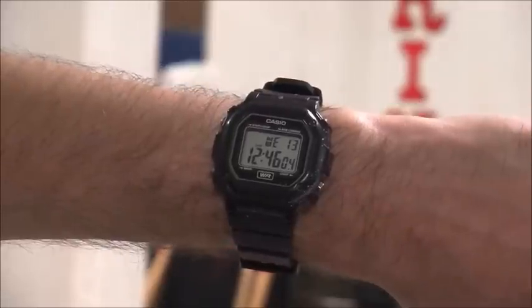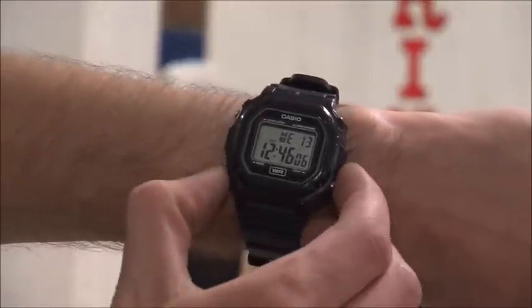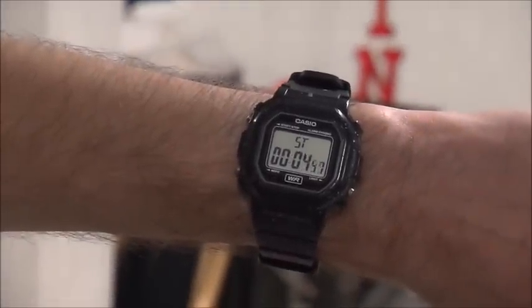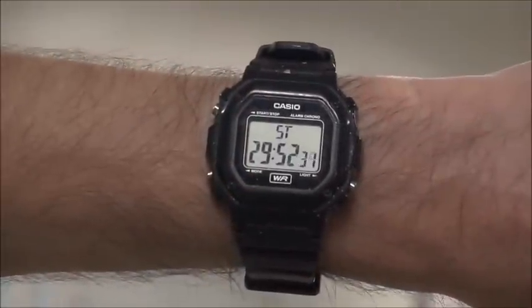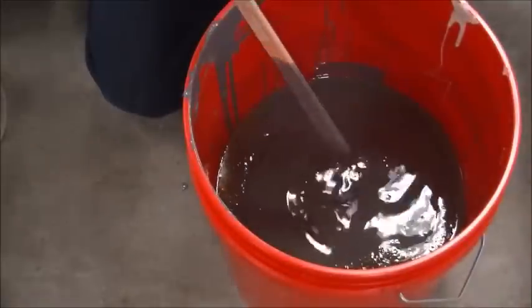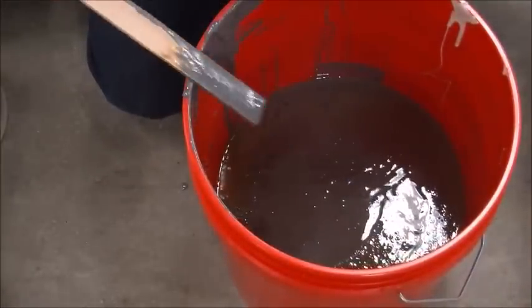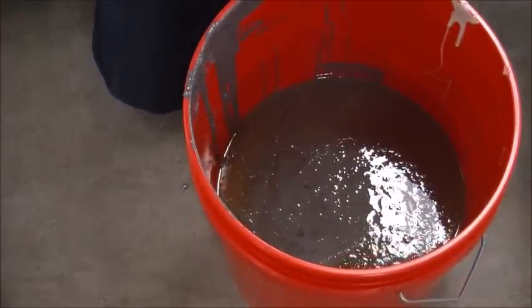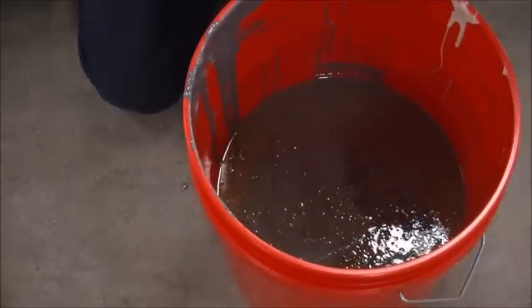Wait 30 minutes before applying mixtures at temperatures between 70 and 100 degrees Fahrenheit. Wait 60 minutes at temperatures between 60 and 70 degrees. See the charts for the appropriate application times and pot life. Do not leave the container in direct sunlight. Pot life is reduced if more than 2 gallons are mixed or if temperatures exceed 90 degrees Fahrenheit. See Chart 1 for details.